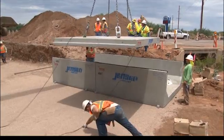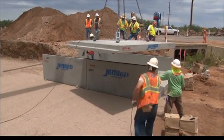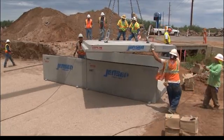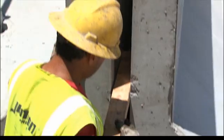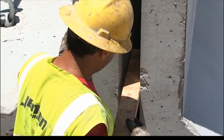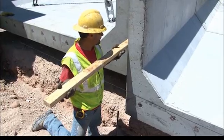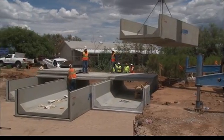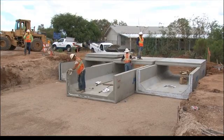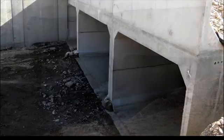To achieve proper sealing of the sections, first set two bottom sections before setting the first top slab section. Normal placement progression will have one bottom section always extending beyond the top section currently being placed. If the culvert run is multi-barrel, a 3-inch space should be left between the parallel culverts. Prior to backfilling, fill this gap with grout or lean cement sand slurry mix and allow it to cure, to ensure that all horizontal forces are uniformly transferred from outer side wall to outer side wall.